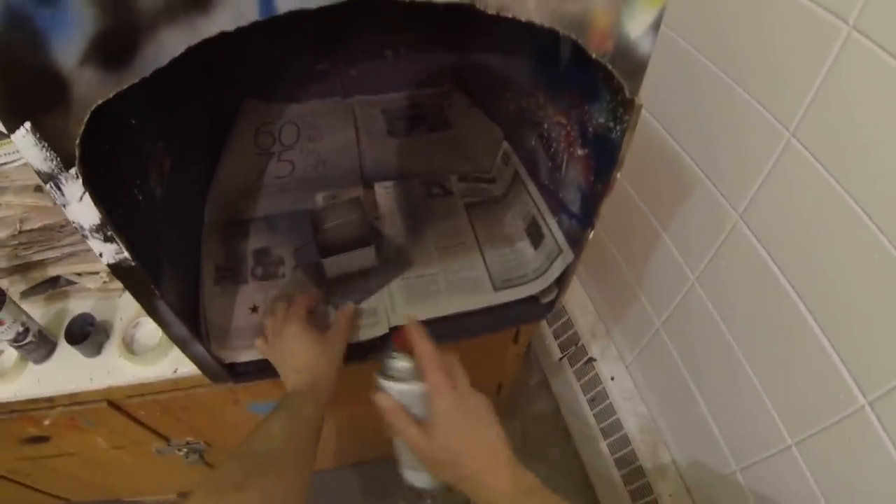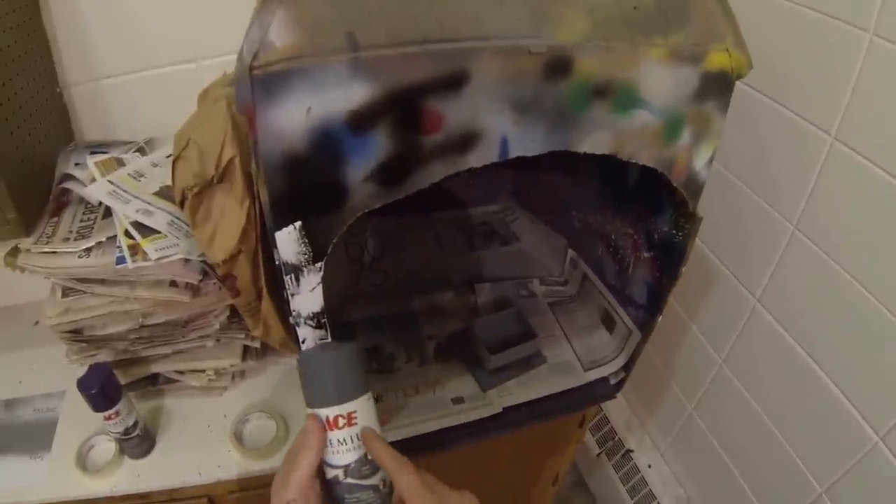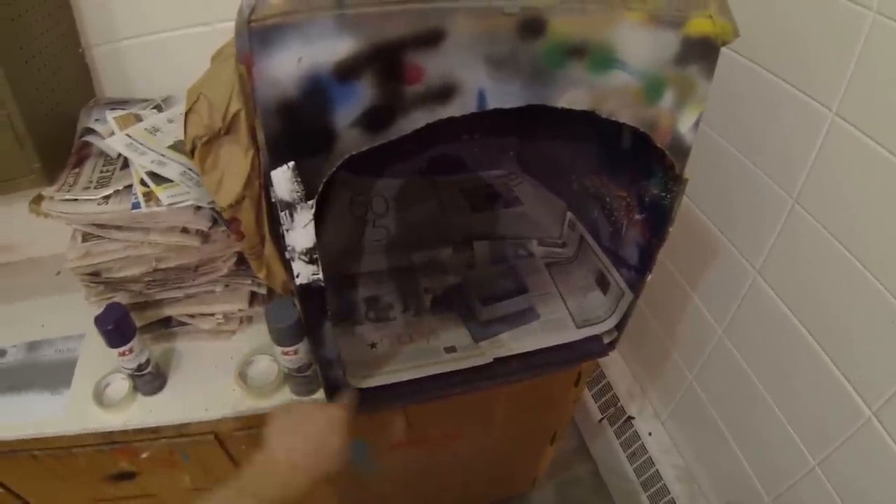It's best to put three or four light coats on rather than one heavy coat. Once you get one coat on, you can flip the box right side up on the spike boards and rotate your product to cover all exterior and interior surfaces. Always have the fan on — it draws the paint residue up and out. Always put the lid back on the can. The can of primer will stay right here so everyone remembers to use it before grabbing their top coat.